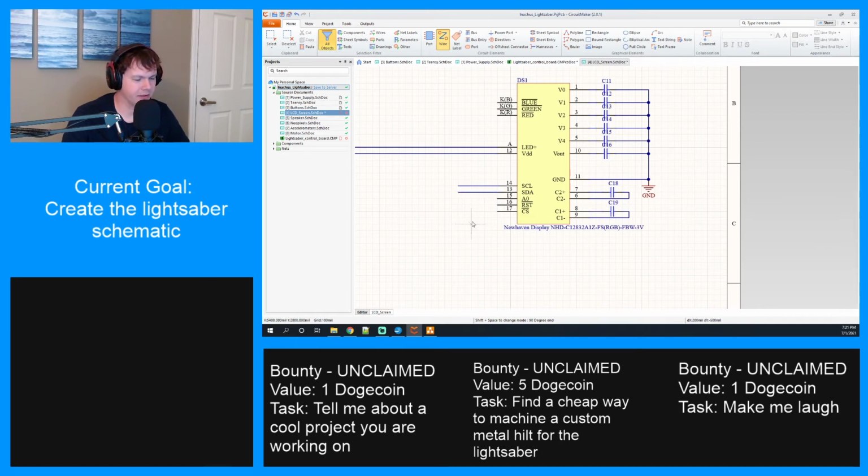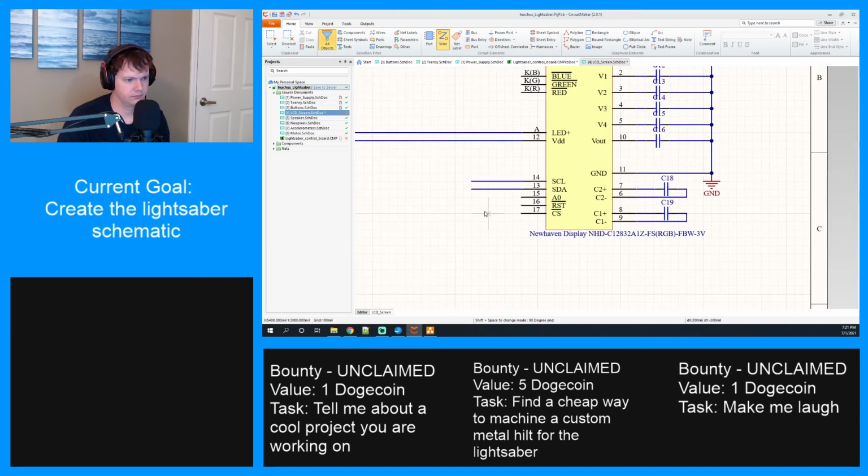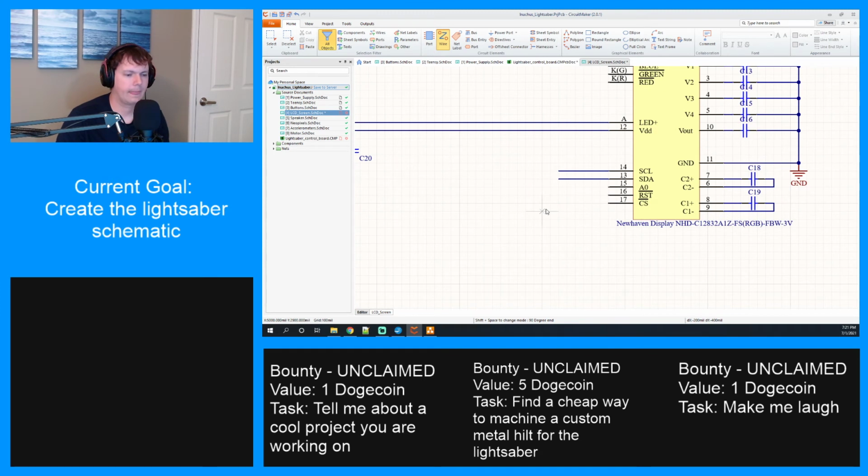I mean, but we can use an internal one too on the Teensy. Just a matter of extra parts added to the board. I'm not gonna. I'm gonna just risk it. So the Teensy has internal pull-ups that'll work just fine for this. These aren't high-speed lines. The SCL and SDA are, but those will be push-pull drive anyway. So yeah. So then, since that's the case, where do we connect everything?